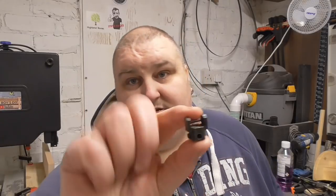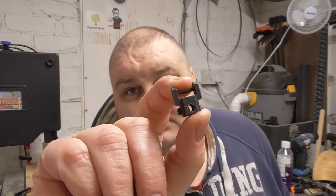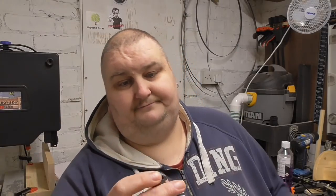Most machines you buy, whether it be a cheap one or an expensive one, should run both sets of blades. I understand some machines won't run pinless blades, they will only run pin blades. These are like a hacksaw blade. To run pinless blades on some machines, you will need some of these, which allow you to fit pinless blades to your machine.